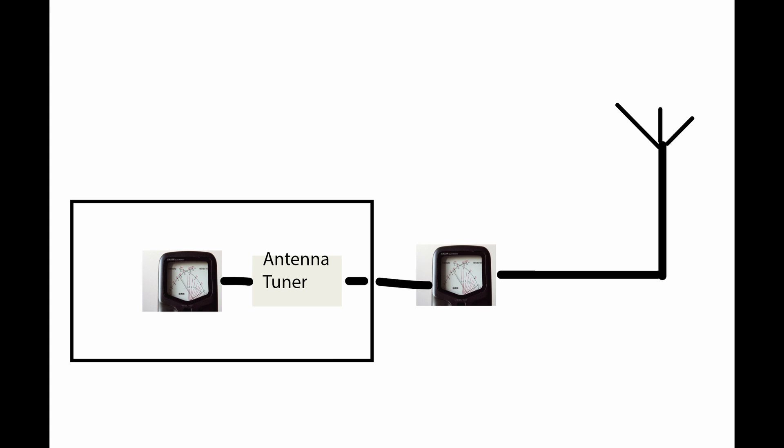When your antenna tuner is switched in and adjusted correctly, the meter inside your transceiver will show almost zero VSWR, which is very satisfactory. But — and it's a rather big but — it doesn't get rid of the VSWR on the coax line to the antenna system. If you have an external VSWR meter, that meter will tell you the truth. The internal meter sees a good match because the antenna tuner is taking care of that, but in real life you've still got VSWR on that coax cable. That's one of the prime reasons for having an external meter. And when the transceiver is fooled into thinking there's a perfect VSWR, it's quite happy to deliver full power, which it otherwise might not do.